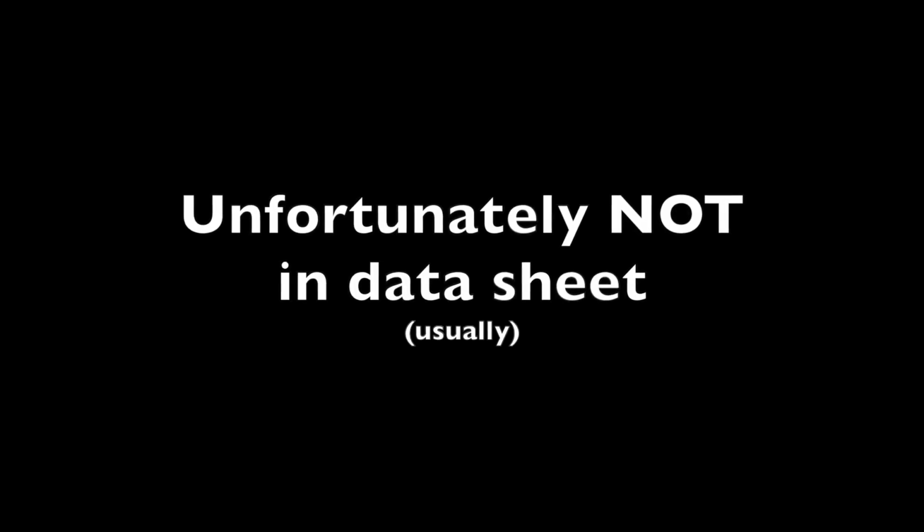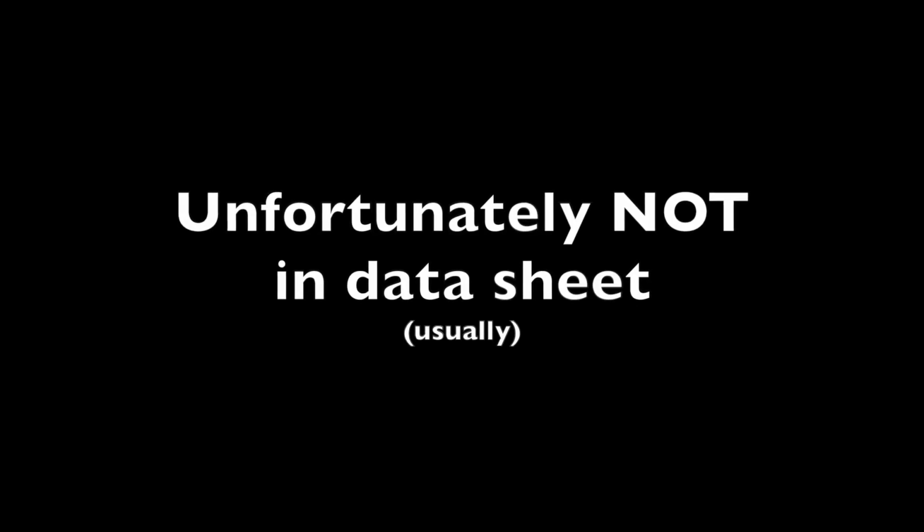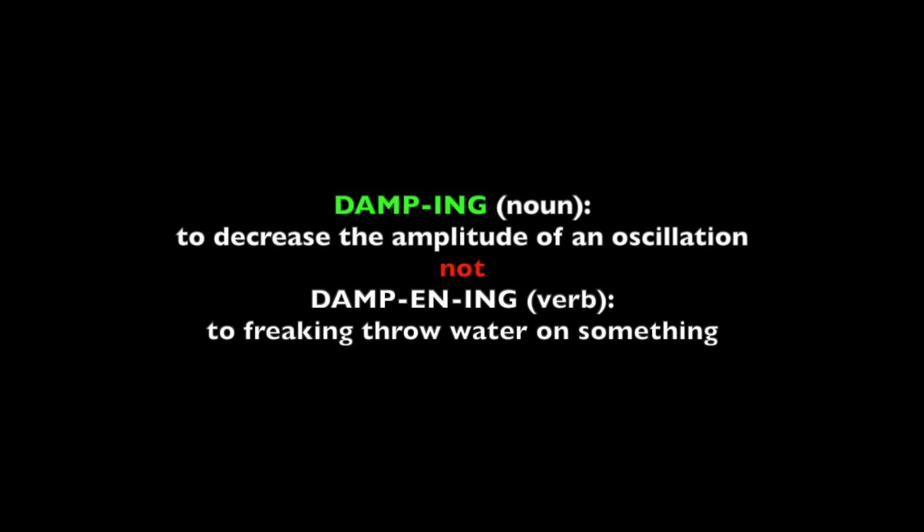Usually, sometimes it is. But the problem is that bounce is dynamic, as in it's not a fixed value across the entire life of the switch, and it varies from switch to switch, dependent on how you're using it, the design of the switch mechanics, as in what type of kinematics it's using and what materials it uses for the spring and the return plates, and the damping properties of the materials themselves. As in, if you bounce a billiard ball off of a concrete floor, it's going to bounce very high, whereas if you throw a beanbag at a concrete floor, it's just going to thud because of the rebound damping properties of the beanbag. And yes, I said damping and not dampening, you Philistines.